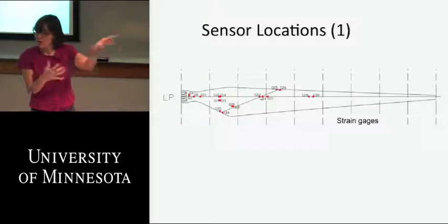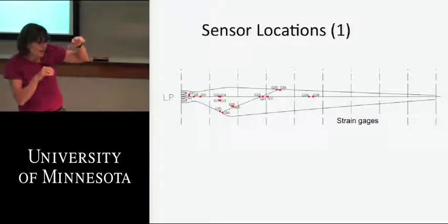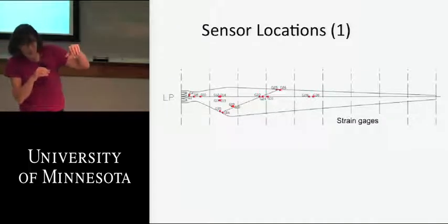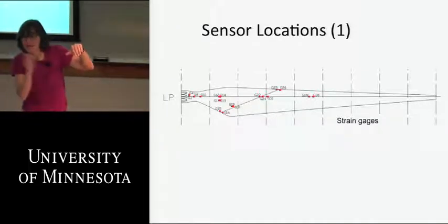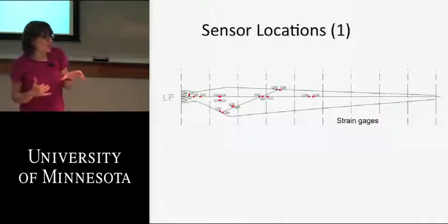So you've got this fiber optic. They put a grating in there. Grating just means some lines. They've etched them in. It's very precisely controlled spacing. They send light through, and that has a certain frequency to it. And when it pops back out, that's how they know which sensor they've hit, based on what frequency they've pulled it back out at. And then if the spacing changes, the frequency is shifted just a little bit. And that's how they get strain with these fiber optic sensors.